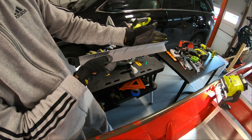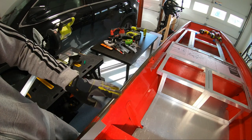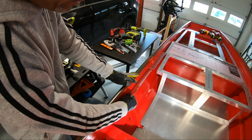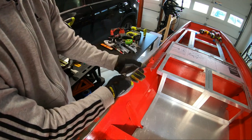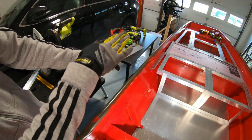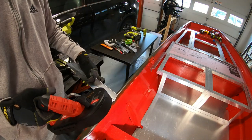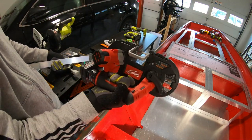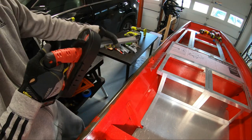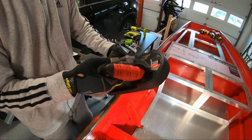I'm marking every two inches so I can flex the angled bracket to the contour of the boat. Slotting it out will also allow me to bend it down, because the side of a boat is not a 90-degree angle — I don't think I've ever seen a John boat with a 90-degree sidewall. I need to bend it down to create a level, horizontal surface for the deck to rest on. This is where the Milwaukee mini bandsaw comes in really handy — it does this quickly, with one hand, making all the cuts at once.